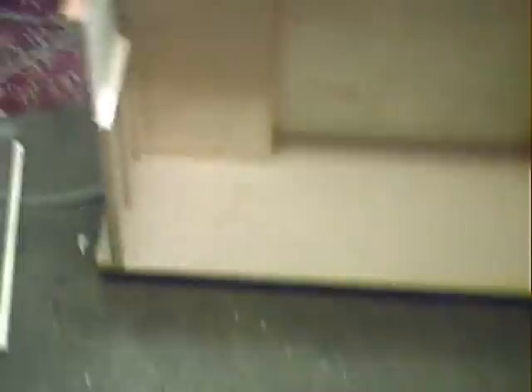That's all seven legs done. The lower cabinet is ready to take the wind chest with all the pipes already mounted — it just goes in one piece, with screws through the outer wall, two screws one each side, just to secure it in place. That's the wind chest with the pipes inserted in the back of the lower cabinet in the place where it's going to permanently sit. There's a fresh piece of timber in there to provide support for the upper display area of the lower cabinet.